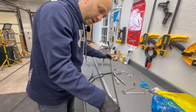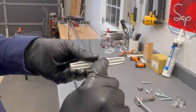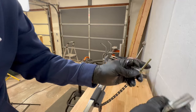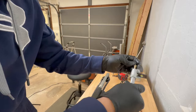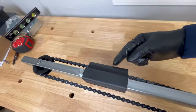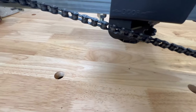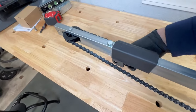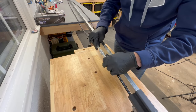You want the silver end at the sprocket on the back with the bracket, and the gold end towards where the front of the door is going to be. Run that all the way back down to the other end. For the next step, we need this little spanner — the side that says 'door' goes to the gold colored bolt. Note it's reverse thread. If you had trouble getting the chain through the inside of the slide, it's likely because your release tab wasn't deactivated — there's a tab inside that tube that catches the chain.